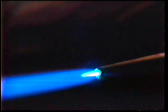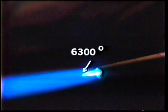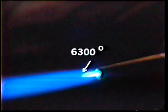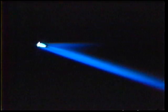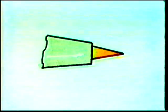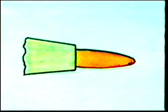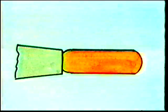The tip of the inner cone is the hottest part of the flame, reaching a temperature of approximately 6,300 degrees Fahrenheit. The shape may be influenced by the shape of the orifice, the cleanliness of the tip passage, and the accuracy of the pressure of the gases. The cone produced by a small tip will vary from a pointed to a semi-pointed shape. Cones from a medium-sized tip will vary from a semi-pointed to a medium shape, and cones from a large tip will vary from a semi-blunt to a blunt shape.